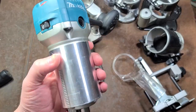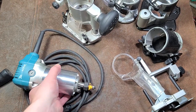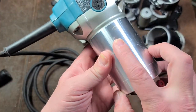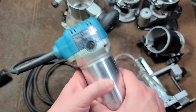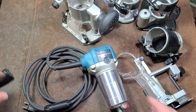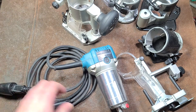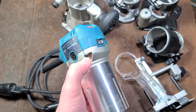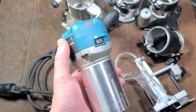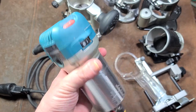I paid $65 for the set even though it's a little bit beat up — it's still more than good. This thing has pretty low hours on it; someone was just brutal with it, not careful with the alignment pegs. Anyway, 6.5 amps is a pretty decent amount of power for a little router, and it's pretty well made, although it does screw into a plastic casing. Routers do heat up and take a lot of vibration, so periodically make sure the screws are tight.